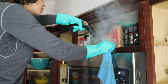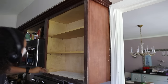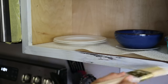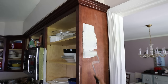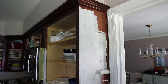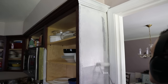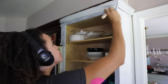I did skip removing the things inside my cabinets — that was the lazy girl in me. For sanding, I decided to try it but it created too much dust and I figured I was going to be priming anyway, so I just decided to skip sanding. The primer I used is an extreme bond primer — you can find it in the blog post — and it said I didn't even have to sand. I wanted to prime because these cabinets are very, very dark. With just one coat of primer it wasn't enough; I ended up doing about two or three coats just to cover the dark cabinet. If you're going from dark cabinets to a light or white paint, you really have to add lots of coats to cover all that dark wood coming through.